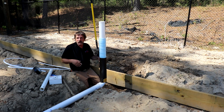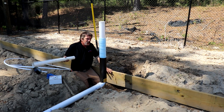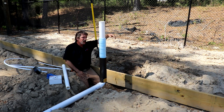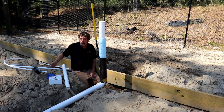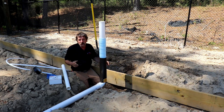I had to get my shovel out here and clean up my ditch a little bit. This ditch has been open for about a week and a half. We've had some rain, so just keep that in mind. When you're doing a slab you pretty much want to bed it that day — cover it up if you can, but you can't cover it until you pass inspection. Most of the time the sewer is on one side of the house and the water on the other, but pay attention because sometimes they put the water meter and the sewer tap on the same side. You want to keep pipes on the same side — don't go under driveways, and keep your pipes as short as you can.